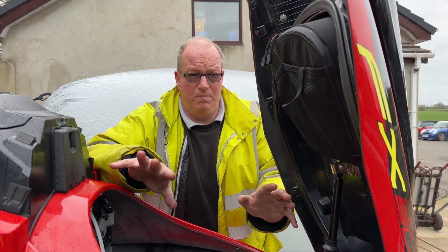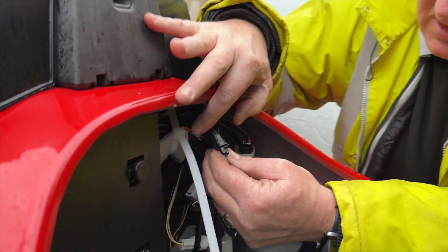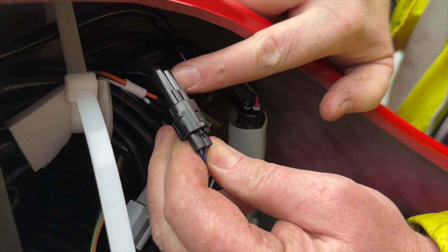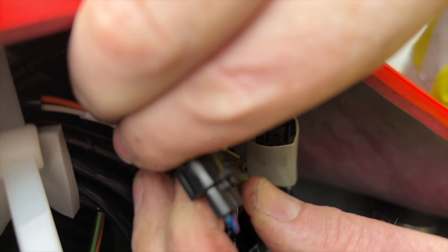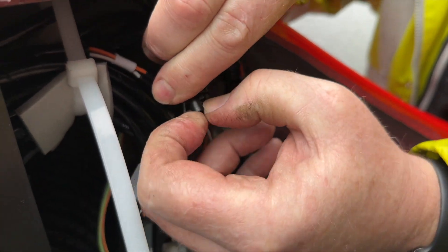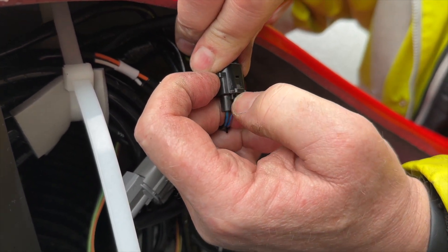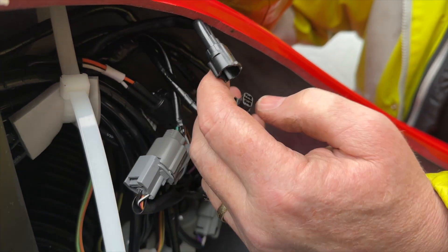I'm just cutting to the chase. If you follow me in here — this is the alarm button here. It goes on to a red and black wire in the main loom, on a red and blue trace. We're just basically going to do that — I can get my finger to it — and that fuel alarm is gone.